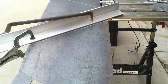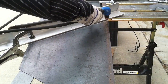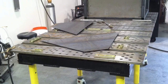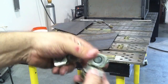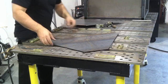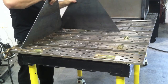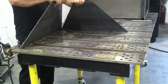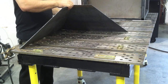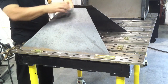Clamping a straight edge, you can cut 16-gauge just about as quickly as you can drag the torch, and it cuts through it really nicely leaving a good finish with hardly any cleanup. For this job I'm just going to knock the rough slag off. I'm going to use these little magnetic V-pads to help me hold this thing together — they're not designed for this, they just have little magnets in them, but it happened to work out as a really quick way to set this up. I'm really finding that I get lucky a lot with this table because there are so many hole patterns and variations of things you can do to get a job done.